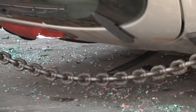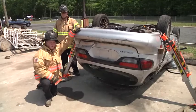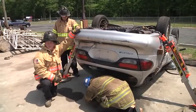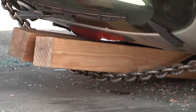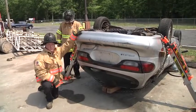As we can see, there's still a little bit of slack in the chain underneath the roof. So what Tony's going to do is come in with some 4x4s and try to take up that slack. It's important to try to get as much of the slack out of the chain as we can so we maximize the lifting potential of the rescue jacks. Once the blocks are set, Tony's going to take a step back and we're going to take an overall view of the bases of our rescue jacks just to make sure they're in proper alignment.